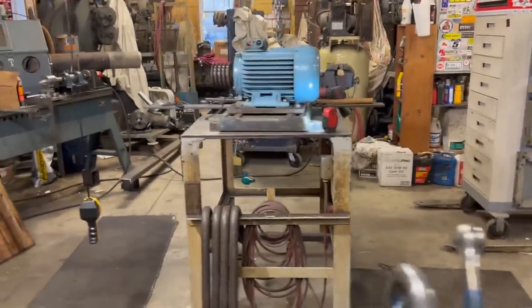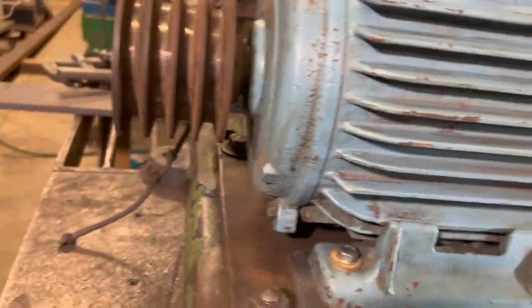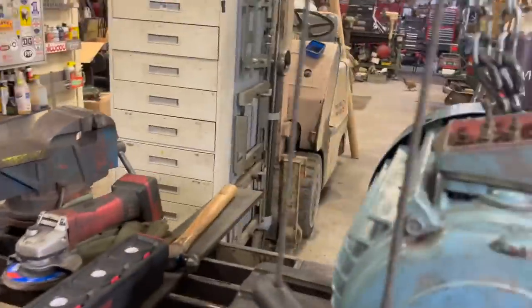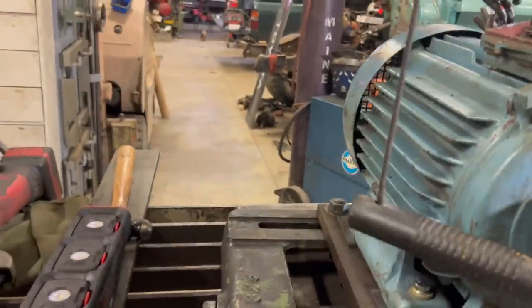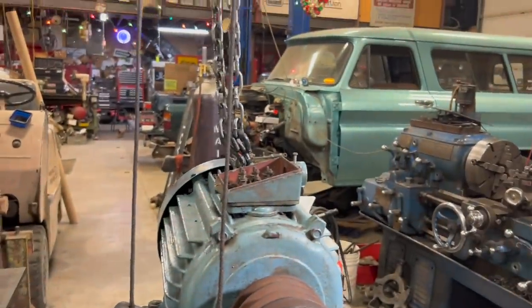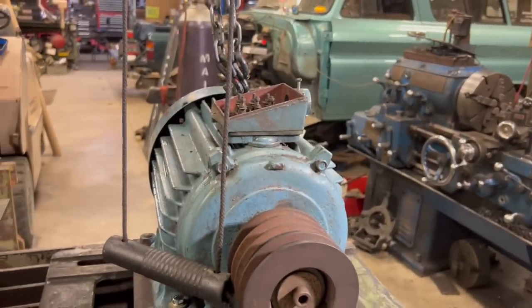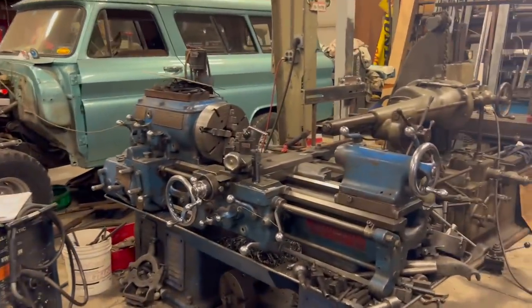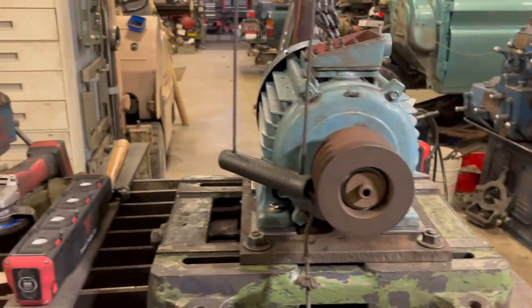When Paul was here earlier we had that mocked up in there. Now it's all welded, bolted, and leveled. I knew dealing with bolting the motor to the plate while it was hanging up there was going to be a disaster, so I resolved that down here first. I'm going to rig this up, pick it up with the crane, get it balanced vertically with some small chains and hooks, get it floating vertically and fairly balanced, and then just bring it in there with the crane. The belt length was right, the alignment was right — all the math and cutting and fiddling is going to be correct. I'll try it by myself and if not, we'll get it tomorrow when Paul's here.